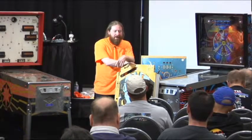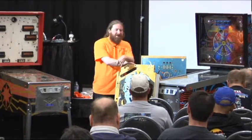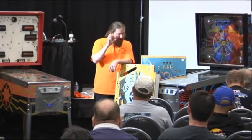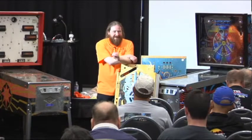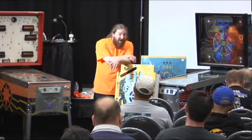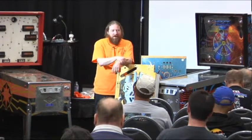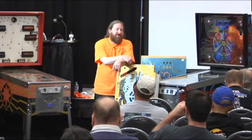As to tips after that, when you have the gun, follow the instructions specifically on that. It's a 2-to-1 mixture, and they'll give you a little mixing cup that you can get and mix it to the T. They've designed that, so there's a reason they tell you to do that. Mix it just right. Gun-wise, they say rule of thumb, use about 2.5 turns on the actual volume. Follow that guideline and then just work it until you figure it out. You have to play with the gun a bit.